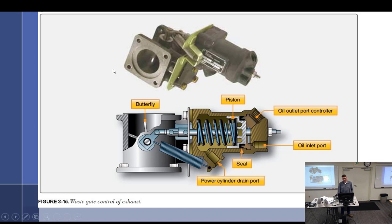Keep in mind that the turbo is never actually off. It can't sit in one spot, because if it did during operation, exhaust gas hitting one spot on the turbine wheel causes cracking. So it's always in some sort of rotational mode, but we'll call it turbo off.